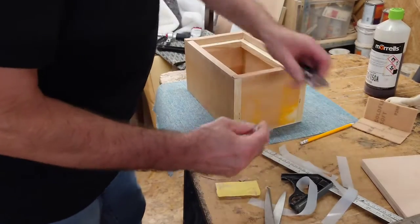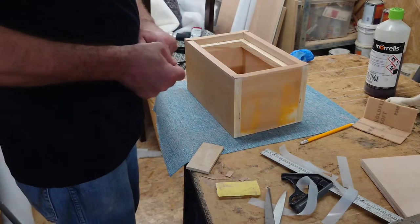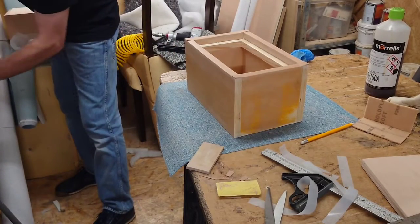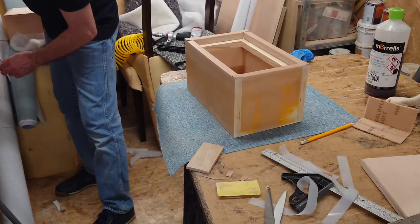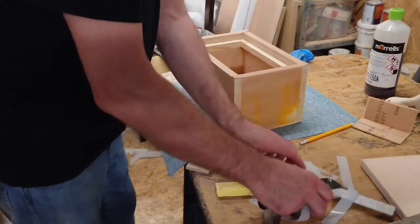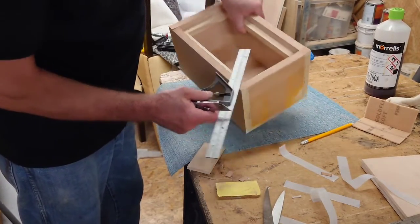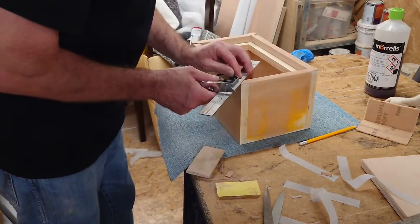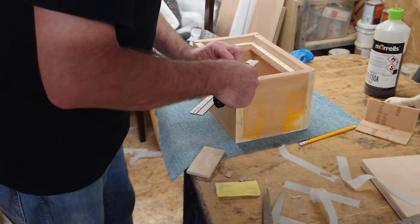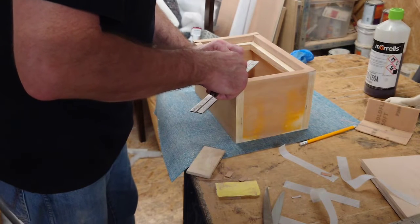So this is the part where we need a blade. It needs to be a sharp blade. I don't use scissors for this, so I'm just going to give this a bit of a blast on the... So I've got that nice and sharp now. So what we do is we get our bevel, you see, and we hold it right into the corner there. Okay, we want a perfect mitre on there. So I hold it into the corner and then we just score through both layers slowly.